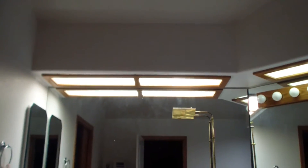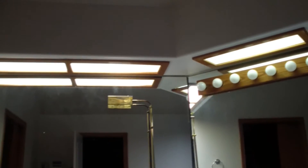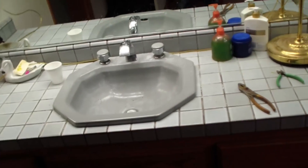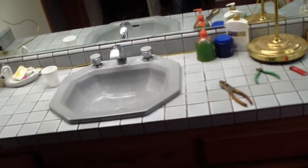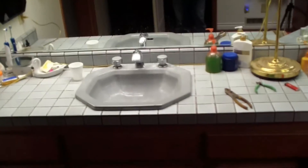Just for comparison, I put the diffusers in. We got the 4-foot high outputs, a regular 2×20-watt regular fluorescent, and then the premium 2-foot LEDs. You can definitely see there's a lot more light from those 2-foot LEDs over the fluorescents — a lot more light. And the high output is really doing well. I don't know whether it's all that much brighter than a regular high output, because just the regular 2-footers seem to give a lot of light. You'd expect twice as much light from the 4-foot versus 2-foot even without the high output, so I don't know whether it's worth spending an extra five dollars a bulb for the high outputs. But they really do look nice — the color temperature is really nice.